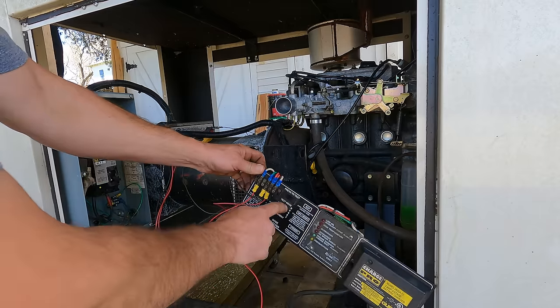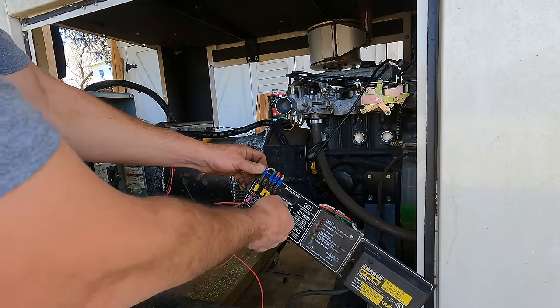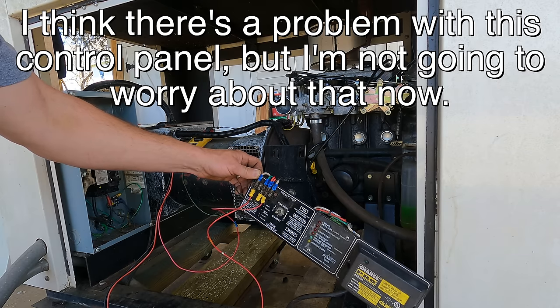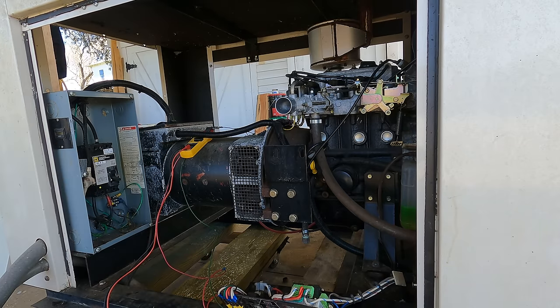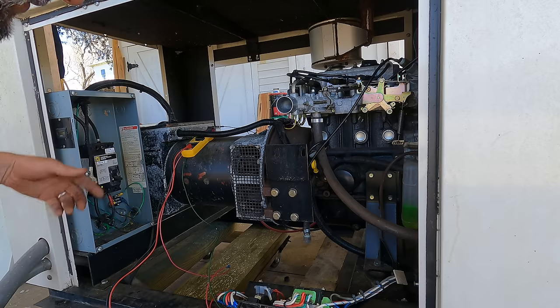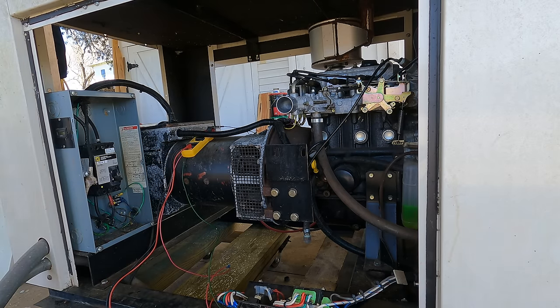I turned that to off and it did not do anything. I turned it to standby, it also didn't do anything. So, how are you supposed to turn this thing off? What I did is I went over and turned off the propane. And of course that did something. For power output, I had like 70 volts between both legs, 19 volts on one leg and 54 on the other when I tested each leg to ground. Something's not happy in there.